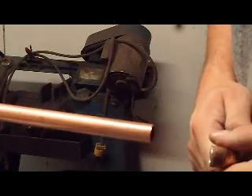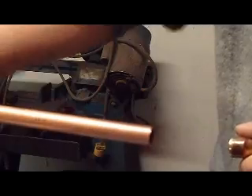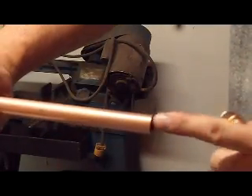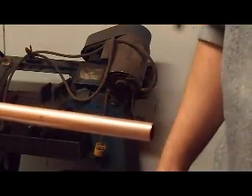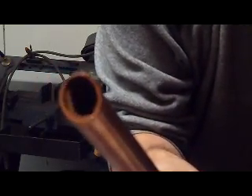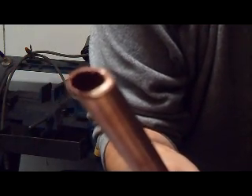I'm going to show you the basics on how to build the actual drill right now — the drill part is also going to be your ground rod and it's going to stay in the ground. What I've got here is a piece of half-inch standard copper piping that you buy for any household project. I have cut the end on an angle. I tried it with a straight cut and it went a little bit slower. The second one I put a bit of an angle cut on it and it seemed to go a little bit faster.